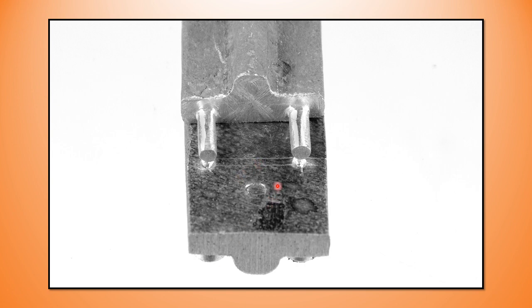Again, what's important to note for me, two things. There's the scribe line that I've got, and then I've come ahead of that, half the thickness of that, or the radius of my tenon, put in my center punch marks, and they're about in the right place. More important is I've letter stamped each end corresponding with here, because these are individually cut tenons. This is going to be an end made to fit these cut tenons, so this whole thing is individual. Let's identify it. It's going to take a lot of the frustration out.